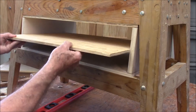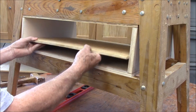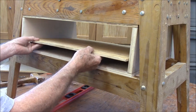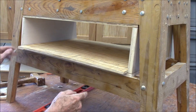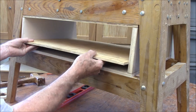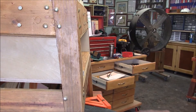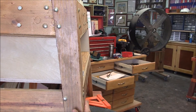This is going to be the size of our drawers right here. I've cut this piece of remnant just to make sure these vertical pieces right here are all plumb and parallel. This will ensure I've got a good place to put my drawers. But as we've talked about, the drawer front — the side of the case here — is angled at about seven degrees. So let's go look at how we're going to have to make the drawer.